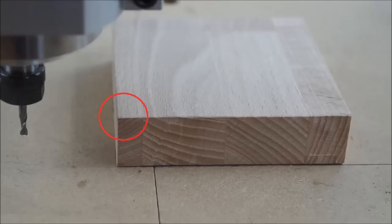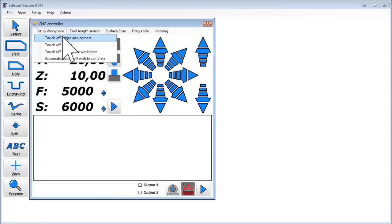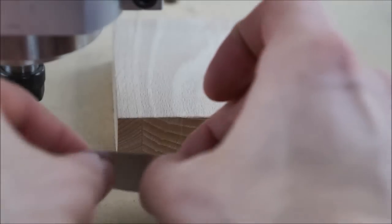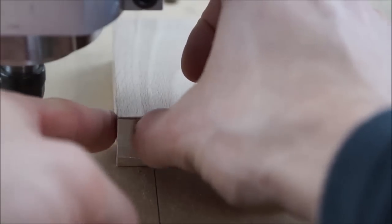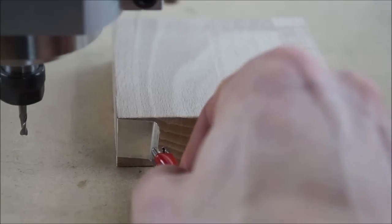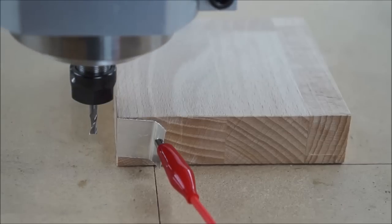Let's first touch off the left front corner of a rectangular workpiece. Select Setup Workpiece, Touch Off Edges and Corners. Enter the tool diameter in the first field, and the thickness of the aluminum tape in the second. Now just stick the tape on the left front corner, connect it to the probe input, and jog the machine against the edge.